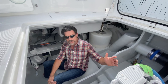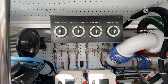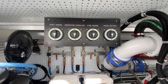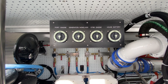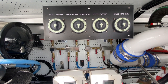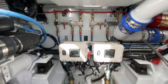Now I'm over on the port side of the engine room. Sam's going to hop down and show you the forward bulkhead. Up above are our battery switches — I've got port engine, generator, windlass, starboard engine, house battery. They're all on one plus two, using both of our AGM-80 start batteries. The idea is that I'm separating my house bank and my start bank. I can always start my engines, my generator, my windlass, and pick up my anchor even if I completely run my house bank dry.